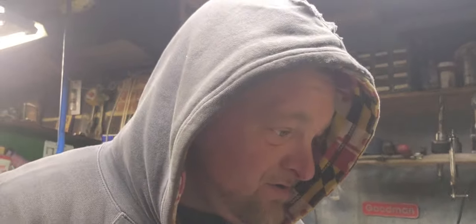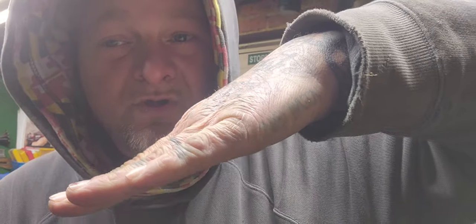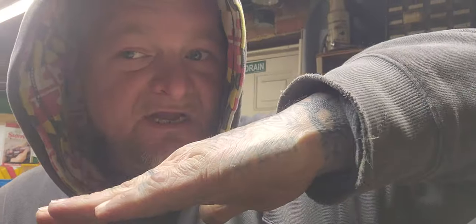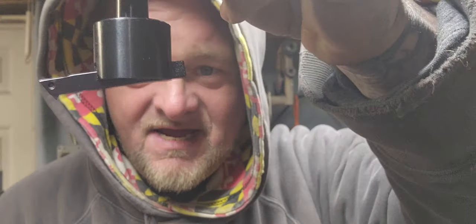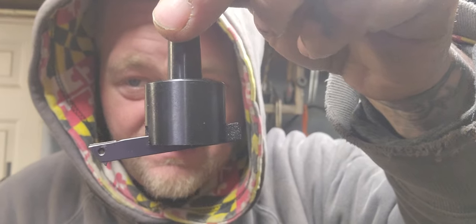On the other hand, you know, a fly cutter. And they didn't even make that right. I had to put this out on a tilt in order to get that to cut right. Their angle or their pitch on this is wrong. I know that you're supposed to have a pitch on a fly cutter. It's supposed to sit on a certain type of angle in order for that cutter to come out. That's the only thing that touches, just that cutter. Well, if you look at the pitch of this, right, and you really look at it, look at how I got it angled, there's no pitch on that at all.